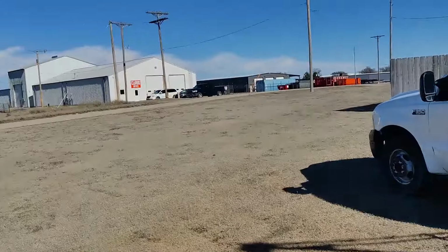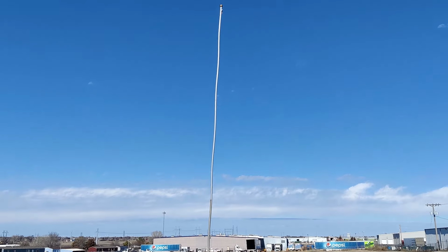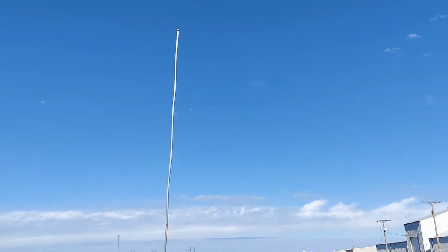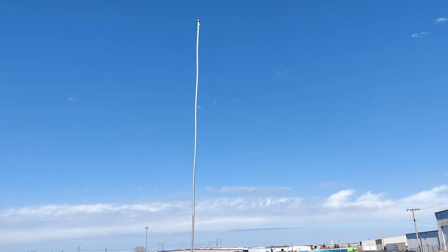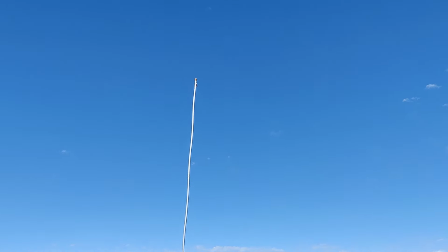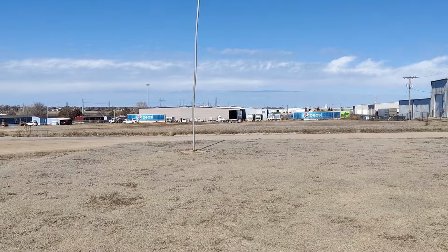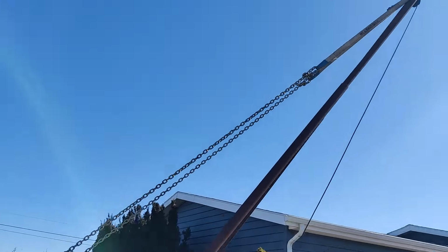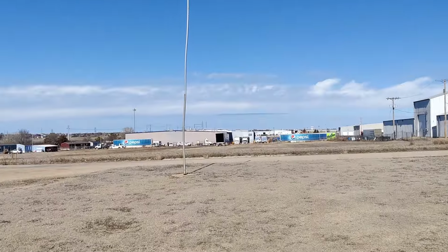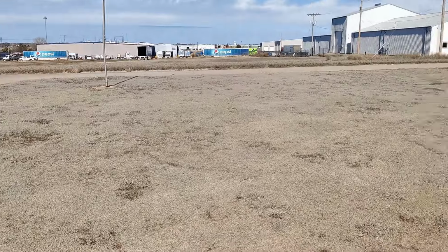And then when I did this flagpole quite a long ago, I went to change the rope on it, and I dropped the rope, and it just went boop, gone. So I might take that thing off, just let it fall, and change the sheave up there, because anytime you work on this thing, you just want to change that sheave every time, so you don't have to have someone come out and do it. I think I'm going to do it myself this time. And I think with these long poles, I can change that flagpole and get it flying again. And then I'll have to get some good flag, about Trump or something.